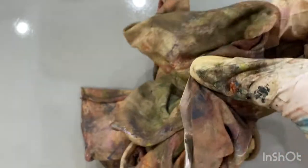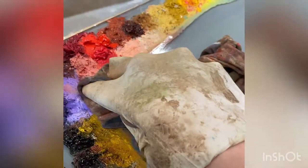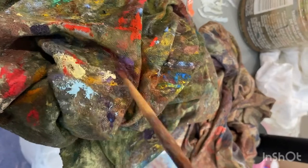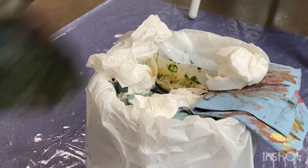It's not a myth. Oil paint and oil painting mediums dry or oxidize when exposed to air, and this reaction is exothermic, meaning it creates heat. If you pile up your oil-soaked rags, the bulky fabric becomes thermal insulation and the center of the pile can get hot enough to cause a spontaneous fire. So the worst thing you can do is pile or ball rags soaked with oil paint into a tight mass, or toss them into the regular trash while they're still wet.